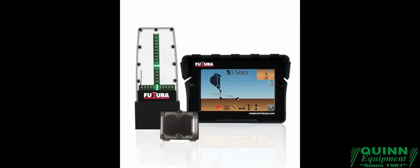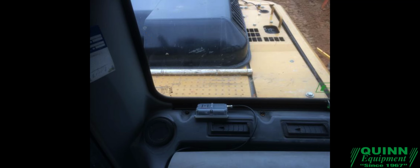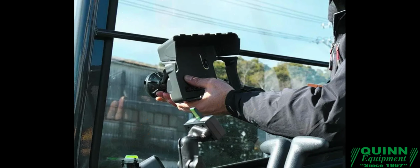Prestart Checklist Number 2. Machine checks. Have you got a safe and suitable location for the installation? This calibration process requires a bit of space to operate the machine in. You'll be rotating the cab 360 degrees and fully extending the boom and bucket. Find an area where you can do this safely. This area will need to provide a stable and level footing for you and the machine. It is crucial that the machine is level left to right to aid in calibration of the boom and dipper. An excavator tipping forward/backward at an angle is acceptable.